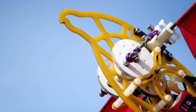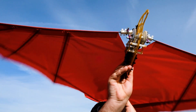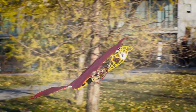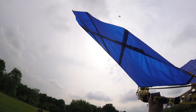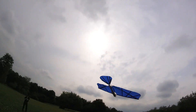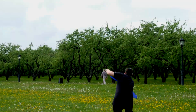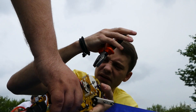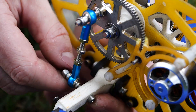Remember my first prototype, the red one? I noticed that the wings flexed too much when it's flying — 3mm rods came out way too flexible. Here in the Bluebird, I installed stiffer 4mm rods, which led to the fact that the bird can't fly anymore. Nylon gears now get turned loose as the reduction gear load increased significantly. Long story short, I have to replace nylon gears with the steel ones.